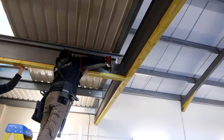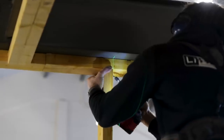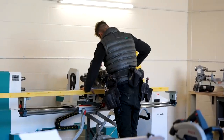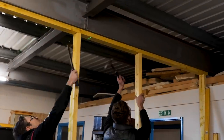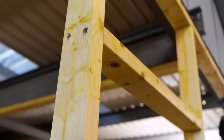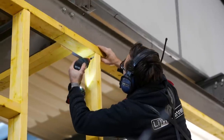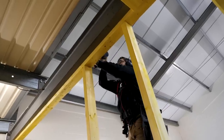Once we had our head plates and sole plates in, we could start marking out for our doorways and all the studs that would catch our boards. I was measuring, Lloyd was marking and cutting — I was staying up the top of the steps and between us we were getting the studs in. This was the quickest way of doing it. We had some really good kit there and we didn't even bring any of our own power tools on site. We went through putting all of our key studs in — doorways first, then corners, then filling in ready for the sheet material — every single stud placed strategically to catch a board joint or door edge, minimising cutting of the sheet material.